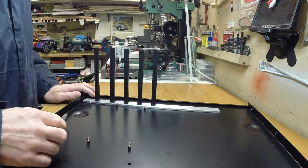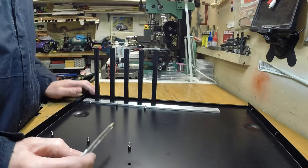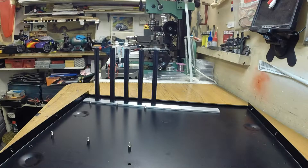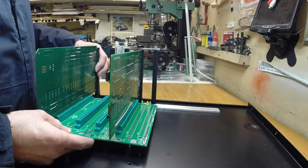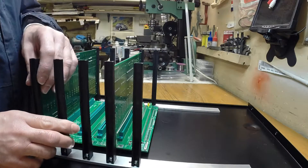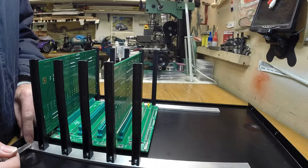The way I did it, I covered the entire base in masking tape - you can't see any markings on this black surface, so the masking tape makes it much easier. I've mounted this about 34mm from the front lip. I've got a couple of cards plugged into the backplane. If you push those into the card guides at the front, they're all fixed. Then get the rear half of the card cage and push that up against there, and you can mark the two threaded holes and bolt them down to the chassis. That makes sure everything is lined up.